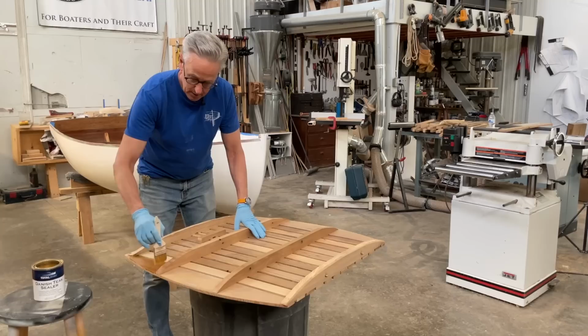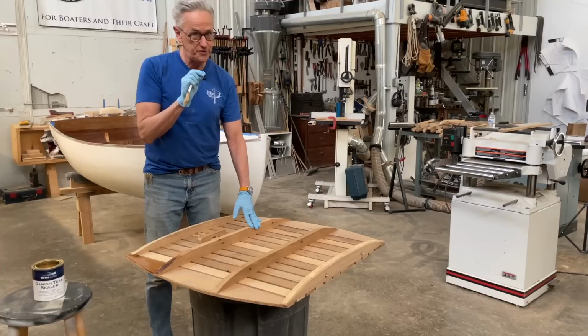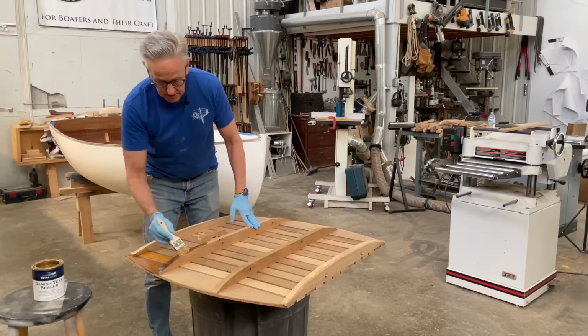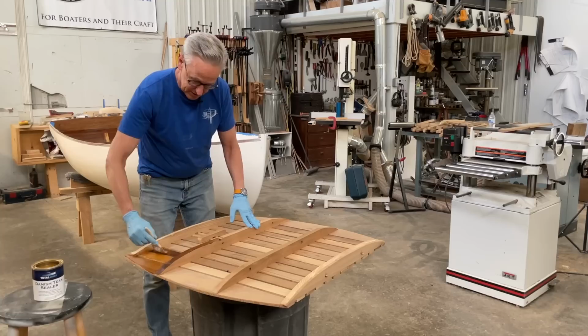filtered linseed oil. Now, filtered linseed oil is important because linseed oil by itself has microbes in it that in UV light will turn black. So the fact that it's filtered, that won't happen. You have to buy filtered linseed oil in pretty large quantities. So Steve suggested just waiting to have the actual finish on it, that he'll put that on this sole when he does the deck of Arabella when he does maintenance.